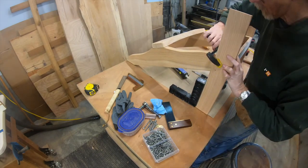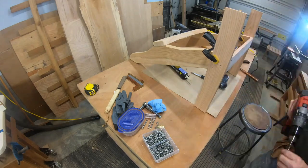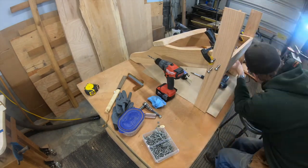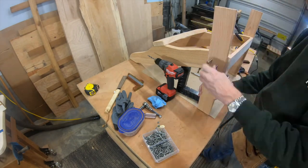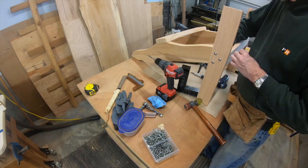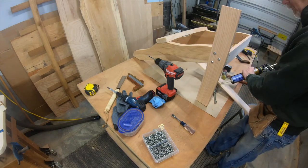Making sure that the legs are square. I cut the angles on the long leg stretchers that go to the back - the front angle and what's on the table there make a perfect 90 degrees. Got my holes drilled, more construction adhesive. This joint here is the most stressed joint in the chair, which is why I'm using carriage bolts. Whenever you get in and out of the chair you're pulling on the arms and your weight lands right there first, so I want this joint to be super strong.